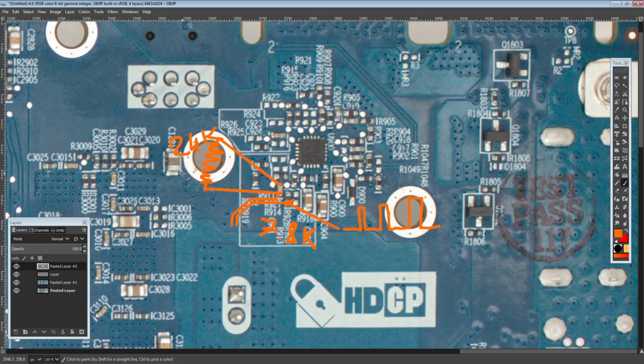Because basically, I wanted to increase the overcurrent threshold, like I wanted to reduce the current monitoring reading by like 10%. So actually, 50 would have probably been closer to 20%, but I wanted to get like a 50 kilo ohm, or a 70 kilo ohm, or something like that. But I don't have any 50 or 70 kilo ohm resistors in SMD, or I'd have to go find one first on some random dead piece of hardware I have.